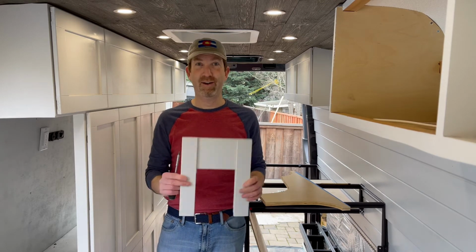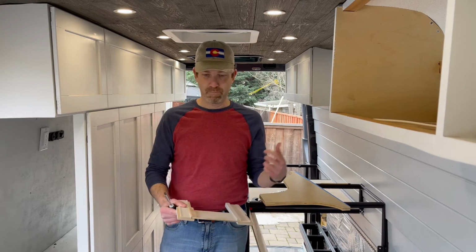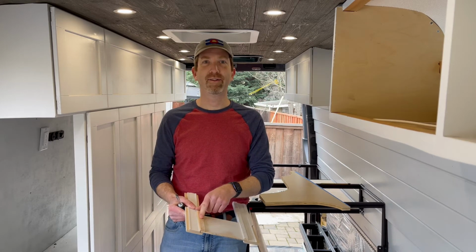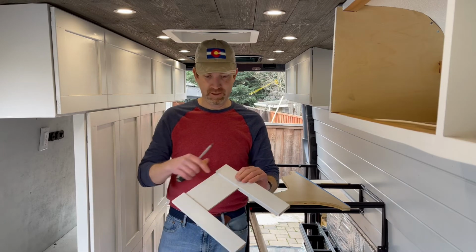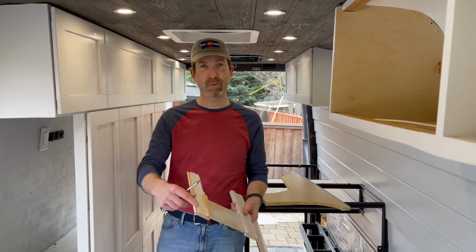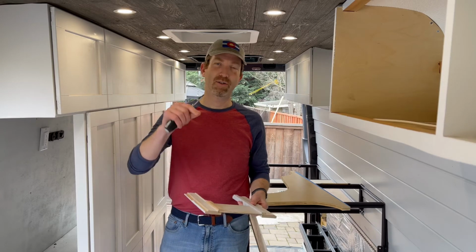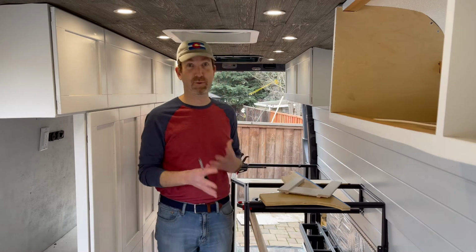Test everything out, do samples. You see it in my video, me doing the screws and so on. Like, this is an example of me testing out the nails. You have to adjust how far they go through, and if you do it too much, they go right through the surface. So, making sure they're the right length, and so on. And here's an example of the notch for my plywood to sit on, and making sure my router is adjusted correctly. Anyways, you get the idea. It's just really good to make sure you do that.